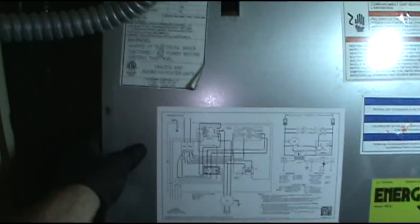No power — no power to the thermostat. So I'll check the float switch first. Always check that first, new guys. Sometimes the float switch would be where the drain pan is, but not this time. Alright, let's take the cover off and see. Check the fuse — fuse is blown. See the black mark in the middle there.